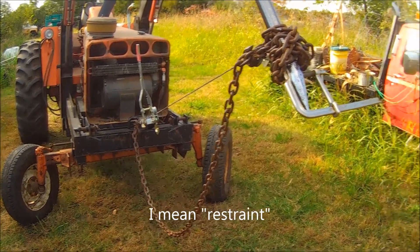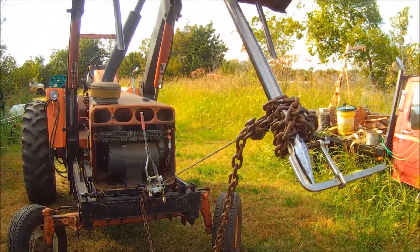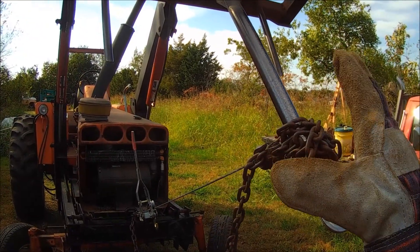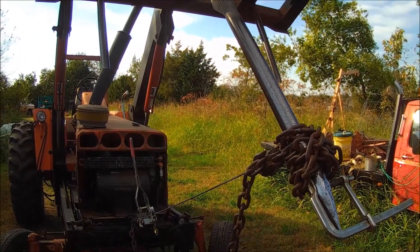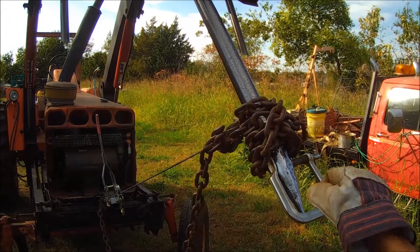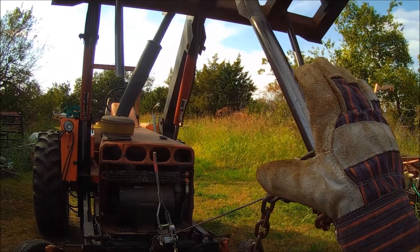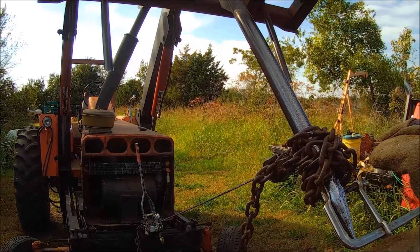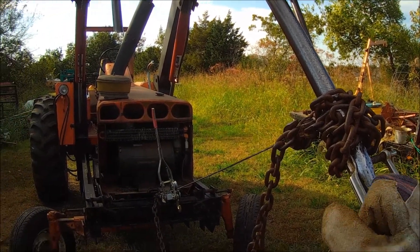You have to restrict this or it won't shrink. If you just heat that without this on there, it will expand, contract — no net gain, it will go right back to the shape it was. But if you've got restraint on it, when it expands it has nowhere to go, so that when it retracts, it's going to pull.